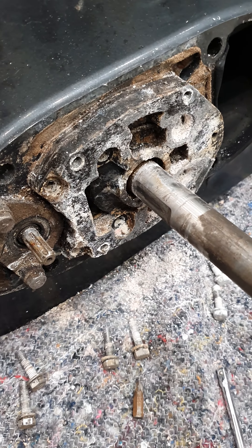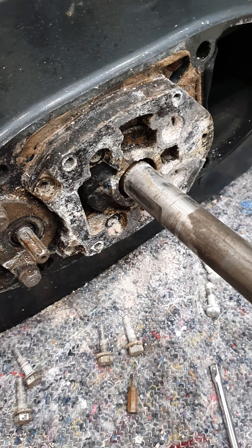You can see that although this was only changed a year ago, there are salt deposits on the bottom of the housing. This was actually done by a specialist a year ago, for which I have a receipt. I'd be minded to say they did a bit of a cheeky job and didn't clean up and remove old parts of the gasket before applying the new one. As a result, salt deposits have got in — the back section has been completely sacrificed, torn off, and the salt has got the whole way through, working its way out onto the surrounding areas. The good news is it doesn't seem to have got any further than where this seal didn't fit very tightly.